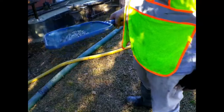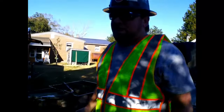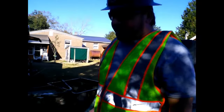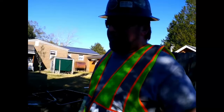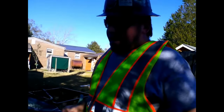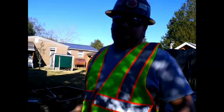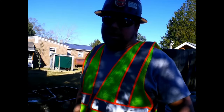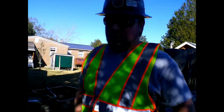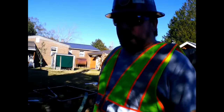And like I said, we'll probably come out of it at about 50, 55 feet here, somewhere in that range, possibly. Just a few miles north of Homestead, North Carolina, up the road where I'm from, this layer of rock is 100 foot thick. So we'll hit it at 80 foot and won't come out of it until 180 or 200 feet. So 100 to 120 feet thick, and it's harder, more consolidated.